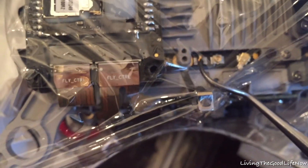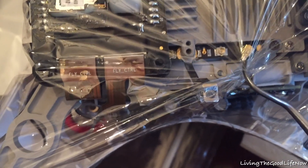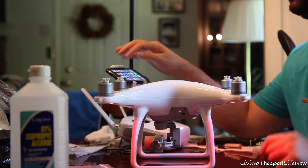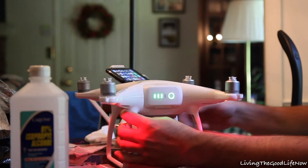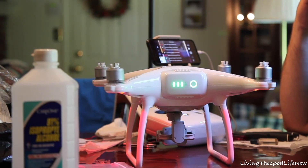As you can see in the picture, I did break one off. One connection ripped off, so you have to re-crimp or solder them for the antennas. There's beeping on one motor, and the back motor is not lit up — it's beeping, so something's wrong with it. On the app it says the ESC motor state has an error.